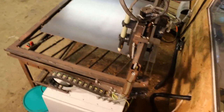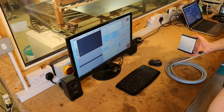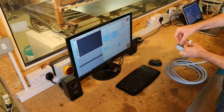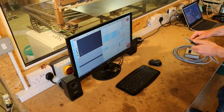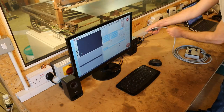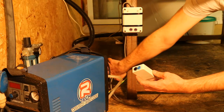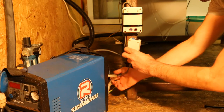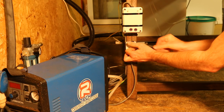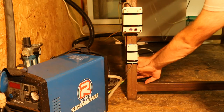The main unit should be installed so that you can easily access it while operating the CNC computer. My machine is in a different room to my computer monitor. I'm going to attach the rubber feet to the bottom of it to stop it sliding around. Now I'm going to run the cable from my main unit down to the CNC control box. The isolation module should be mounted near the plasma cutter — I'm going to cable tie it to the leg on my CNC machine here. Then I'm going to cable tie this cable back along the leg and bring it back to my CNC control box.